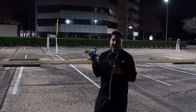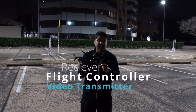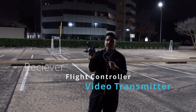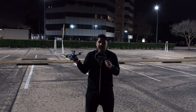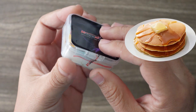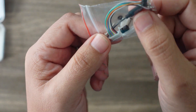This is the ExpressLRS all-in-one board — and when I say all-in-one, I mean flight controller, receiver with a ceramic antenna, and VTX. That's right, a true all-in-one board. Your quad is only going to have two layers; you're not going to have to do hardly any soldering except for the motors. The fastest build I've ever done. The HappyModel Pancake all-in-one board comes with a tiny little bag of goodies and a series of harnesses and pins.